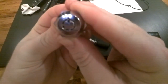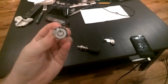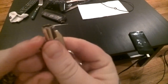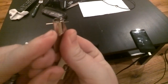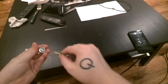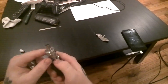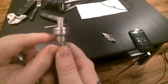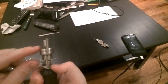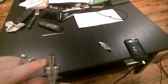The pins are arrayed along the side, so rather than a normal padlock or door lock that has the pin and tumblers coming down from the top, these are arrayed in a circle, and the key has these little depressions along the side that push the pins back a little bit so the plug can rotate. The pick has little arms that come out from the sides that you use to manipulate those drop points, much in the same way that you would with a pin and tumbler lock.